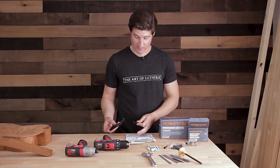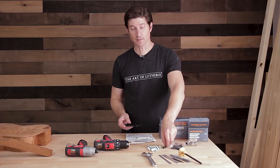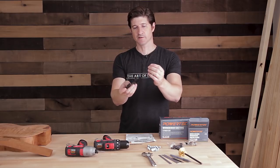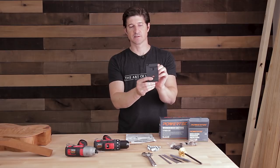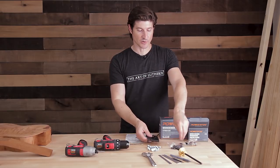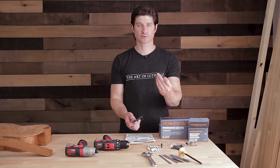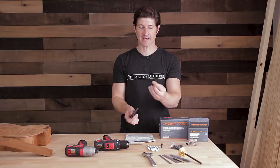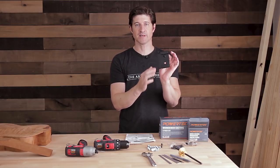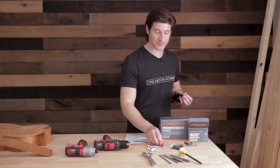Until I read that there are two different mounting techniques. The bolts it comes with have, I think it's called a bugle head, I'm not sure, but they're made to fit into the countersink of this. That way it's not going to interfere with the caster sliding in. It also looks like it will increase alignment and give it more strength, whereas with the screw, the bottom of the head is just flat. If I put that in here, I've got a sloppy fit, and the round shape of the head is going to stop the caster from sliding in. No problem though. I'm glad I figured that out before I drilled my holes in the workbench.